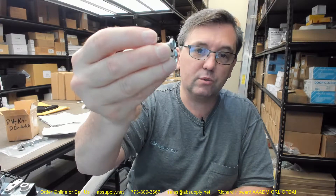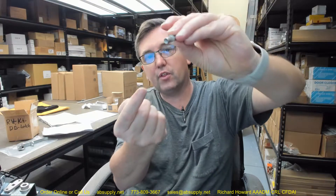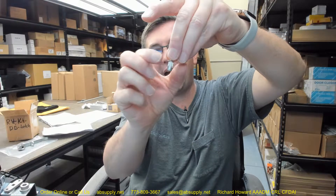You'll get four small hex cap screws. You'll also get three riv nuts. What a riv nut does: you place it into the hole — those splines on the side are intended to keep it from spinning. You bring the nut down into it, and as you tighten, you draw the threaded portion up and fold out the hollow area. That's how you make the mechanical attachment on the outside of the unit itself. So that's the exterior side, and again, you can padlock it.